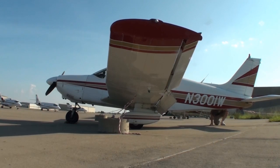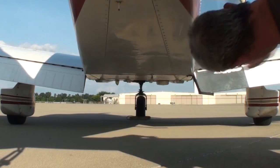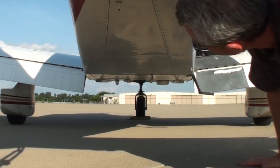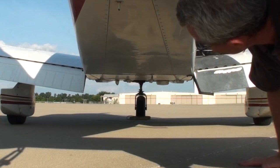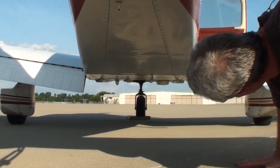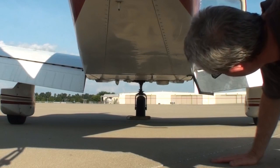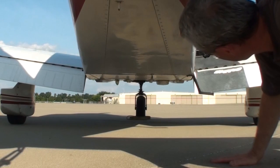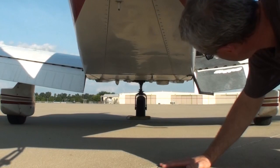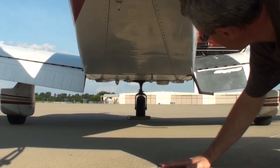When I get to this point I like to give a good look under the aircraft and scan all the way from wingtip to wingtip, looking at the underbelly and fuselage for anything that doesn't look right — any buckling, dents, or anything on the underside. I'm also looking to see that there's no oil out of place streaking back along the belly. From here I also have a good view of the tires, checking inflation and looking for any obvious flat spots. All that looks alright.